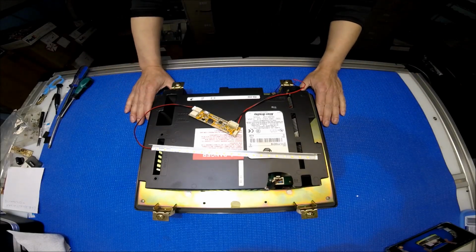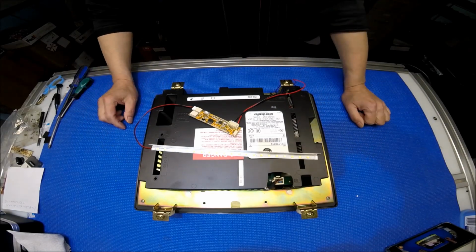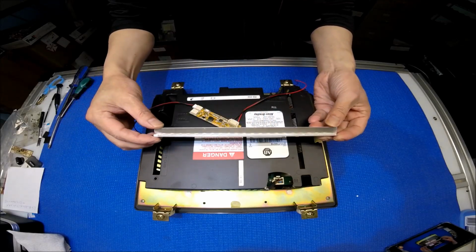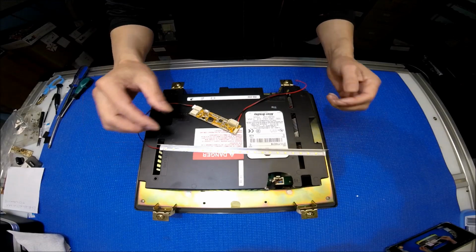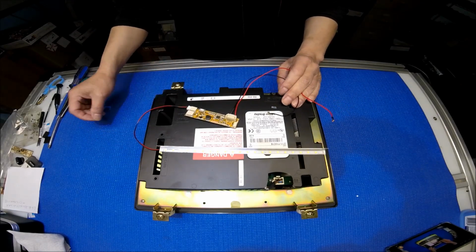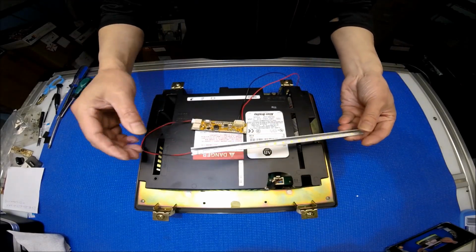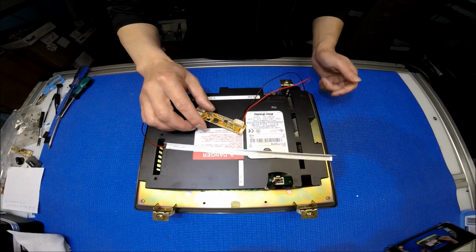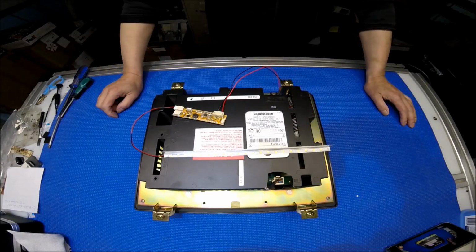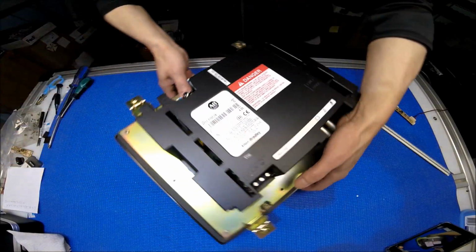Hello, in this video, I would like to show you how to use our newest LED upgrade kit we call the LSR series, which is LED strips already taped to L-shaped reflectors. This particular kit is for a Panel 1000 HMI. The kit comes with the LED kit with reflectors, drivers, and wire with small hooks. I'll tell you how to do it. There's no soldering required, but before we do it, let's check out the number of this display.